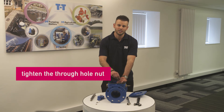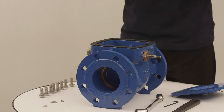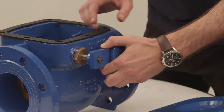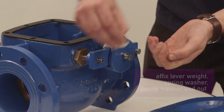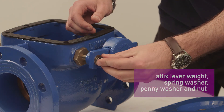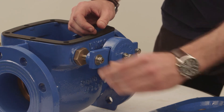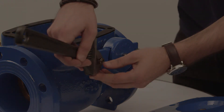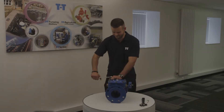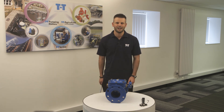Re-tighten the locking screw and tighten the through hole nut with the spanner and then affix your lever weight. We then reapply the penny washer, spring washer and nut. Finally, tighten up ensuring that when in a state of no flow the lever arm hangs just below the horizontal. Once you've replaced the top cover the job's done. I hope this has helped and provided you with a useful guide to changing the side of a lever weight on a swing check valve.